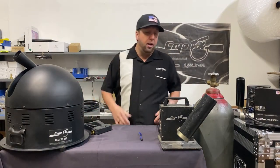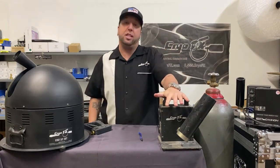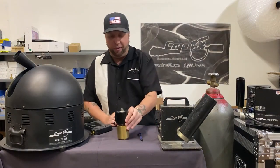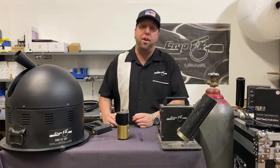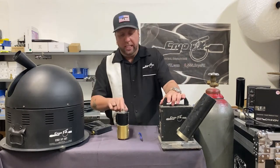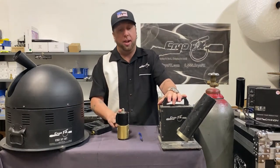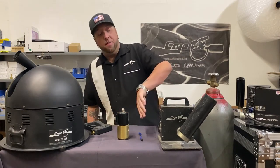How does the CO2 jet work? We'll start with this one — this is the DMX 512 CO2 jet from Cryo Effects. Inside all these bells and whistles is just this little valve right here. That's a liquid CO2 solenoid valve, also called a cryogenic valve. This valve controls everything — the CO2 flows through it, it turns on and off, that's what makes the CO2 go out or stop.